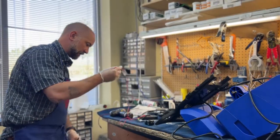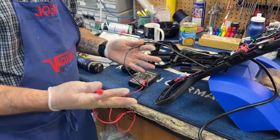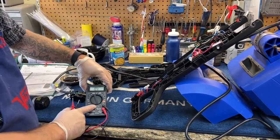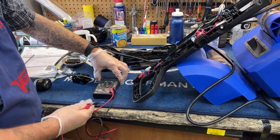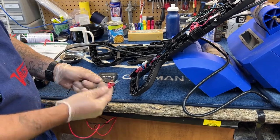So I'm going to use a multimeter to test the cord. On my multimeter, that's the setting I use to test continuity — they're all a little different, but that's what I use. I'm going to make sure that my multimeter is working right, and it is.